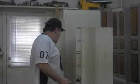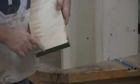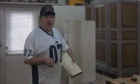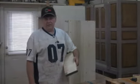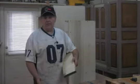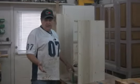So all of that said to say, if you go to a mill and you buy your wood rough cut, first thing you're going to notice is they've either painted the ends of it, or you will notice little teeny cracks in here. Now the first thing is you never call them a crack. A crack is kind of harsh. They're referred to as a check, a seasoning check. And it's pretty much a given that you're going to chop the end off all of these, every one, because it's going to crack a little bit in here. And that's because it's drying out the most through the end grains. So sealing the end grains is important.